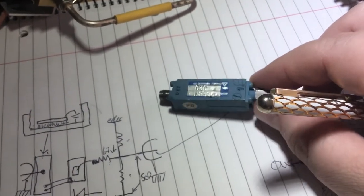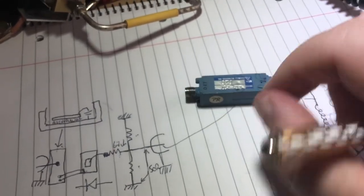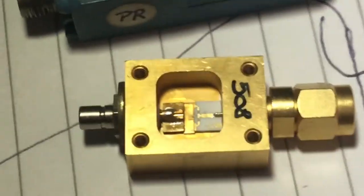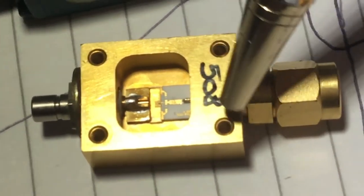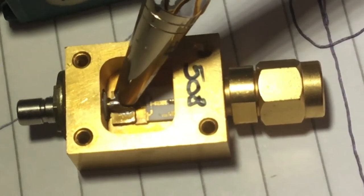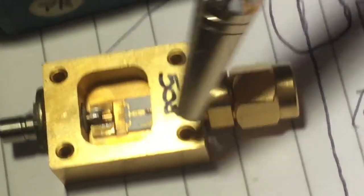Using this replacement diode may get us out of a lot of trouble. The only other option is to purchase a very high frequency switching diode that I can solder directly onto that module — soldering onto that tiny little island after the resistor and connecting it to the land. There are Schottky diodes that go up to that frequency that I could use in that example.